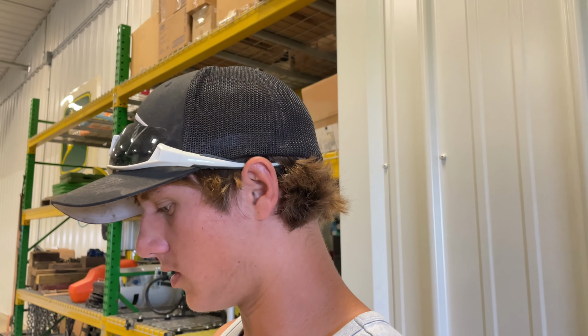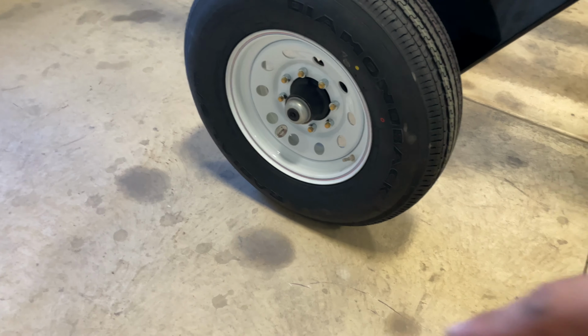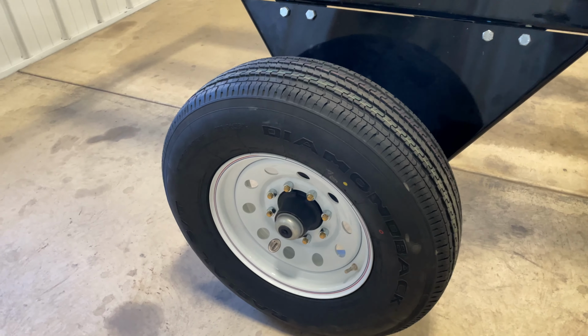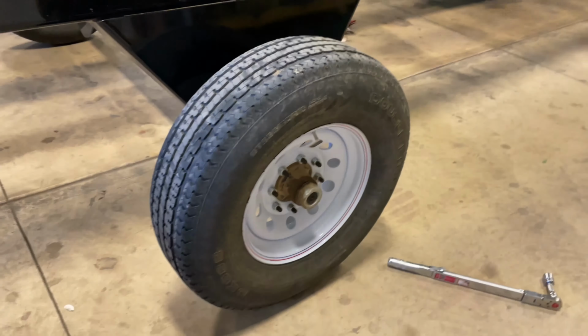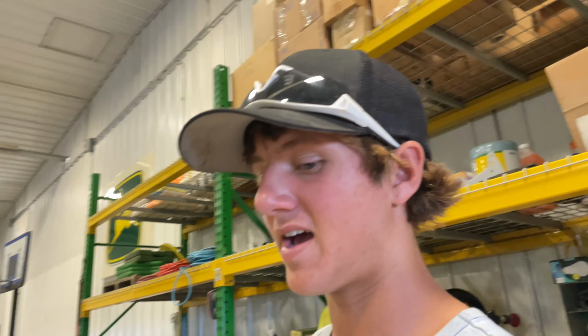And so now I'm gonna go ahead and check the torque on those lug nuts on both of these 2 rims. I don't have a book for this trailer, I don't think. And if we do, I can't find it. So basically what I'm gonna do is take the torque wrench and torque those lug nuts until one of them moves. And I'll just go with that torque spec. So I don't know, it probably won't be that accurate, but at least it'll be something.